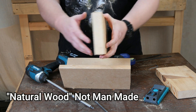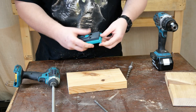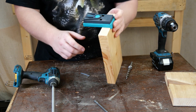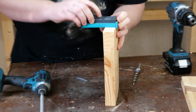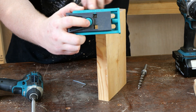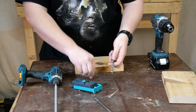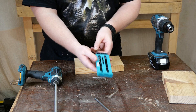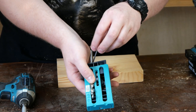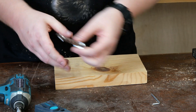Next, we're moving on to man-made wood — a lot thicker. Let's push it as far as we can go and see how it works. This time measuring the wood, which is just over 30mm, so I'm going to set it to 27mm on the little push bar. You just click that button in and move it across, because the next setting above that is 38mm. Set it in there to the 27. Same process again.